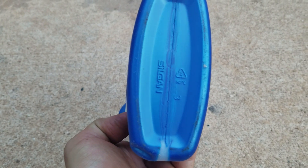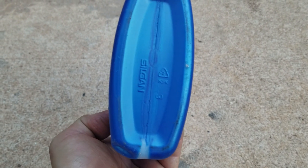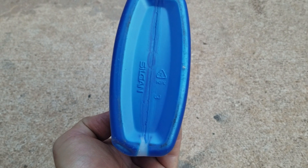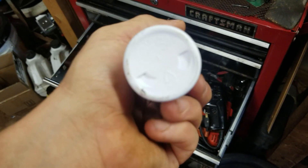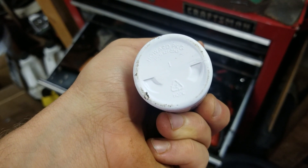I'm going to show you how to identify what type of plastic you're working with so you can get the right filler rods. It can be very difficult, especially on automotive parts. Here's a weed killer bottle — on the bottom it says HDPE, with a triangle and a two in it. That's high density polyethylene, so you want high density polyethylene filler rods. Here's some assembly lube — on the bottom, also HDPE.